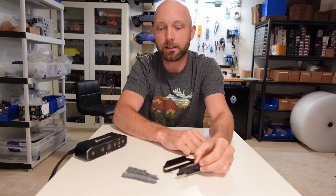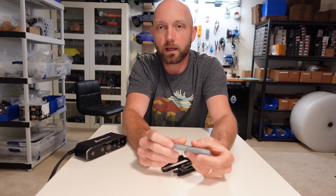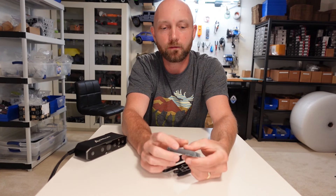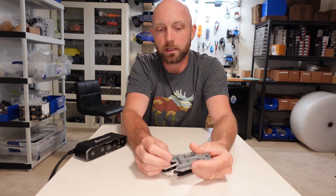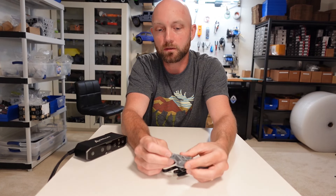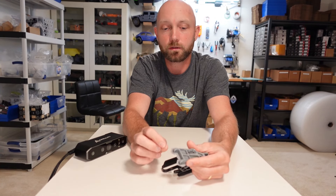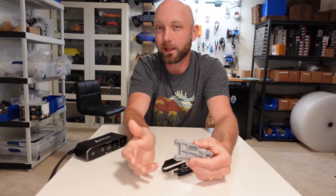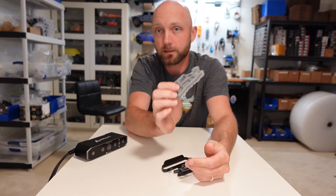Let's take this and get it installed. One thing to note is that any through holes for screws are not going to scan in nicely, so those are something you'll have to drill out. You can get the location from the scan, but they won't come out perfect. Measure your screws: if it's an M3 screw meant to slide through, drill a 3mm hole; if it's supposed to thread into plastic, go with about a 2.6 or 2.7mm hole.